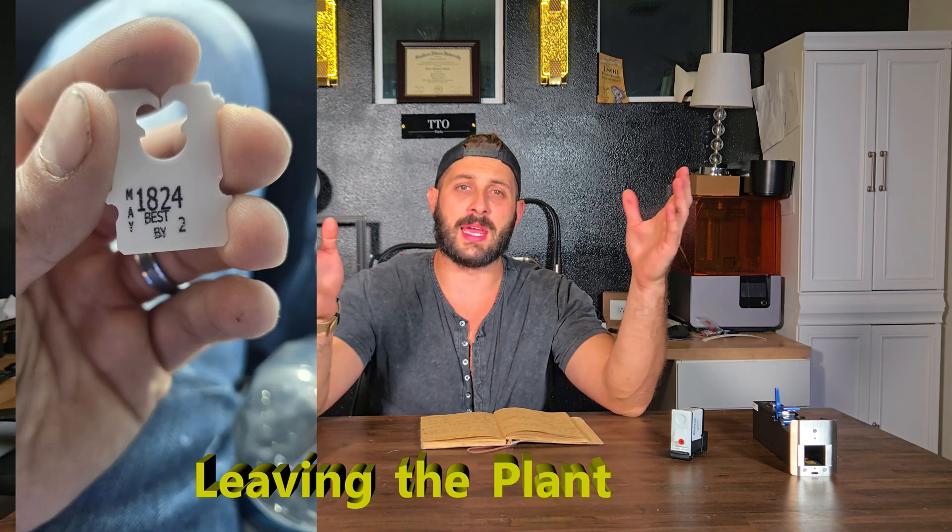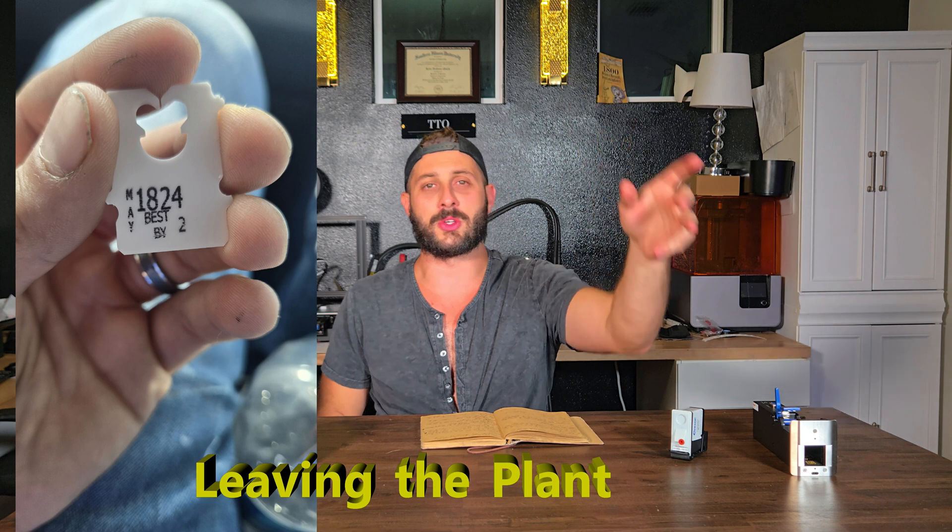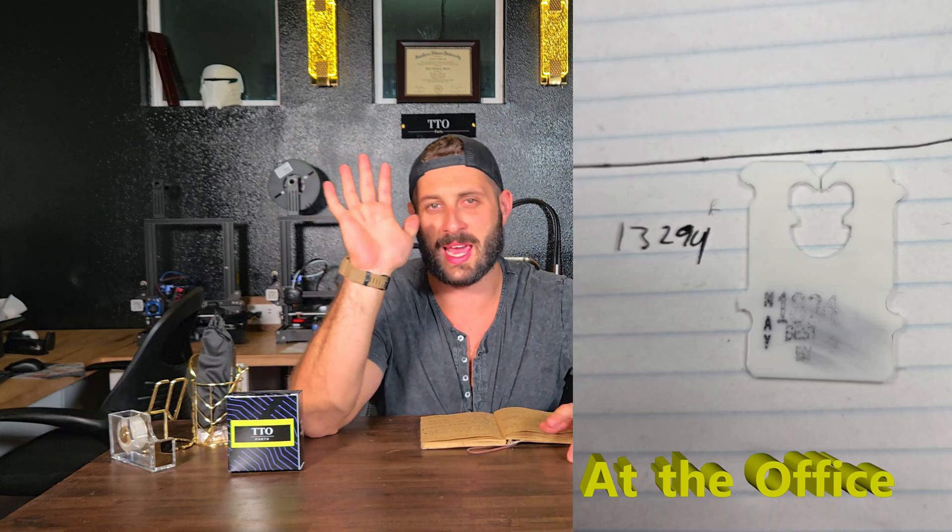What drove me crazy was the material. I didn't know the material was going to be an issue. We ran the test prints and everything looked pretty good. Didn't like the 600 DPI — noticed some smearing, especially right when it came off the print. So we turned down to 300 DPI, a little bit less ink and resolution, but it was adequate. We were happy, it still looked good. Left for the day, put some samples in my pocket. By the time I got out of the truck and back to the office, took the samples out — and they were completely missing any best-by date. We got a problem.